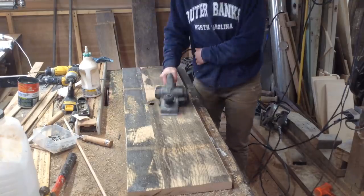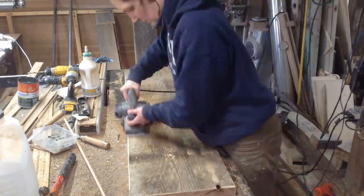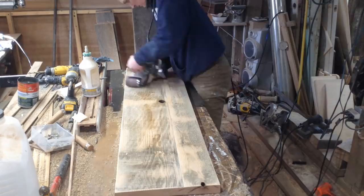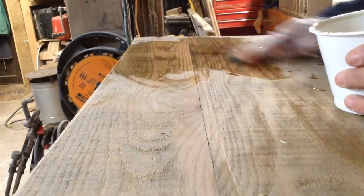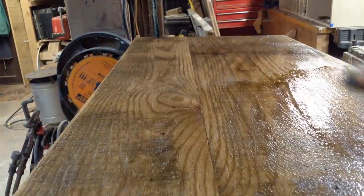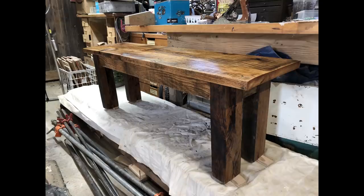To work on the top — this is the bottom — I take off a little bit of material and test out how I want it to look, since no one's going to see the underside. I use a power planer on a very low setting, only removing a little bit at a time. If you take too much away it's going to look like brand new oak lumber. I gradually take off the high spots so the low spots stay, and that's where you get the rustic look of rough-sawn lumber. Once I get that patchy look I take a belt sander and clean it up, then send the customer a picture — they'll say more or keep it the way it is. The finish is Waterlox, because that's the finish I used on the table — to get the best match especially over time, since wood will change color a little in your home if the sun hits it, you want to stick with the same finish. And those are the two benches.